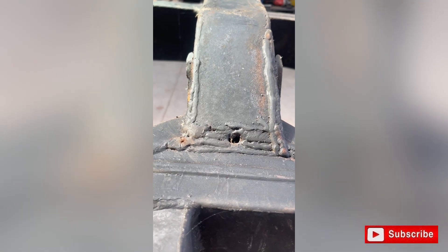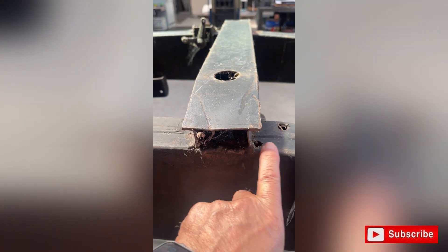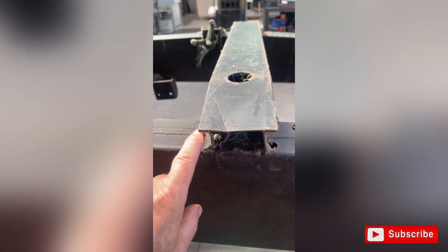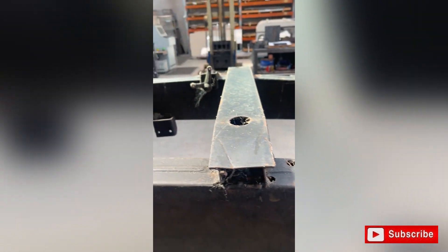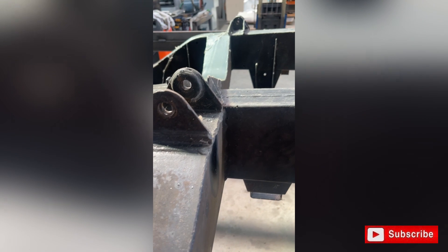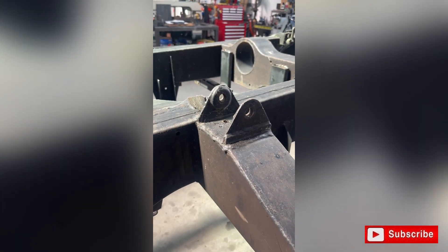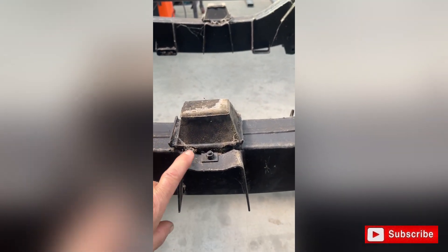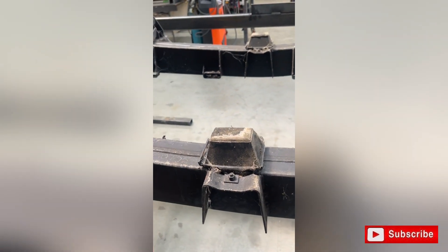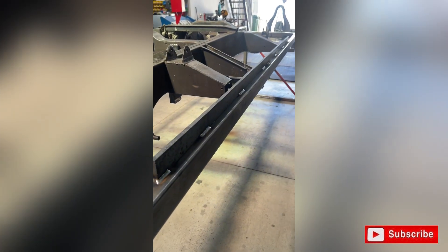This section is a bit nasty — just what we typically see on these Land Rover chassis. What we're going to do is create a bolt-in section: we'll weld a pad here with a little shoulder on it, then put two bolts through so we can bolt this section in and take it out. There's not really much we can do to improve the rest of it — we need to leave it looking and feeling much the same so it retains all the right dimensions and character of a typical Land Rover chassis.